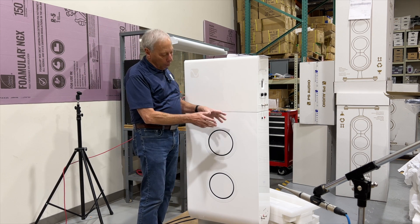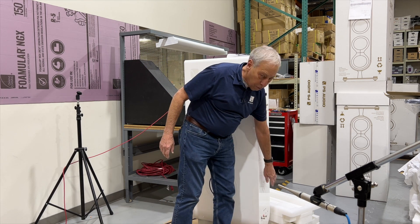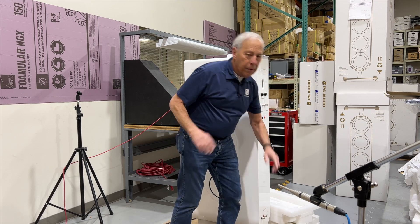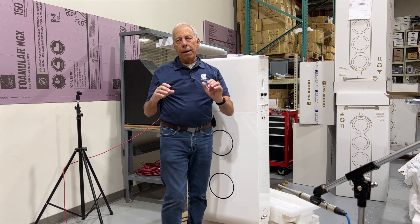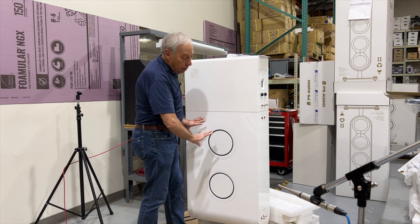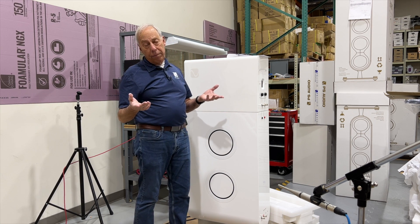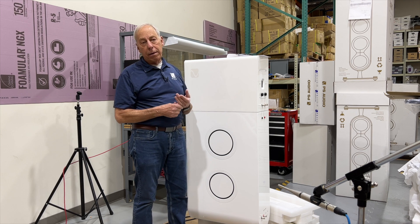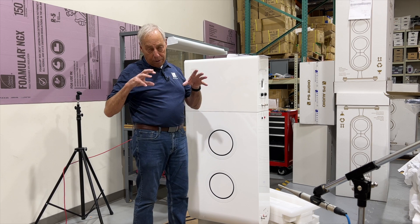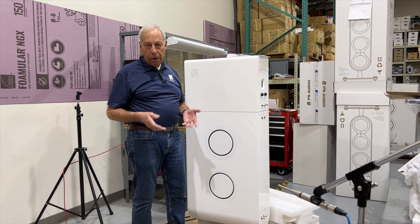The second way of doing it, probably the most popular and most ubiquitous, is a ported loudspeaker. A port is basically a tuned hole in the cabinet. If you put a properly tuned port — a hole — in the box, and you've seen ports before no doubt, usually in the back, sometimes in the front, sometimes down-firing, that extends the bass by giving some of the back pressure in the sealed box a chance to get out at certain frequencies. You can actually get a lot more bass than if you didn't have a port.